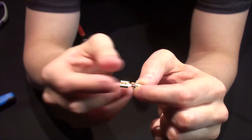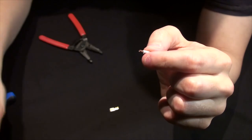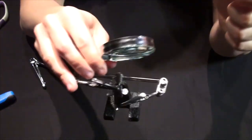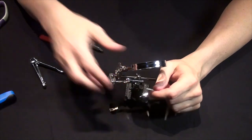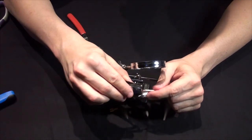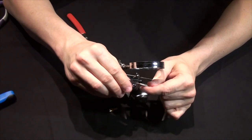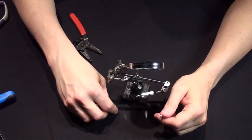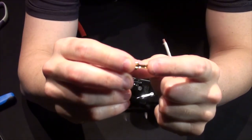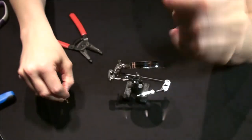Once you get that, we'll go into crimping. If you cut too much of the jacket, the toenail clippers are here to help. A magnifying glass or a soldering setup can be helpful, especially if you can't see things up close very well. Trim any loose strands to make it even. There are a couple ways you can adjust it — you just want it to fit just right. The big wing is where your jacket's going to go, and the small wing is where you want the exposed wire to be.